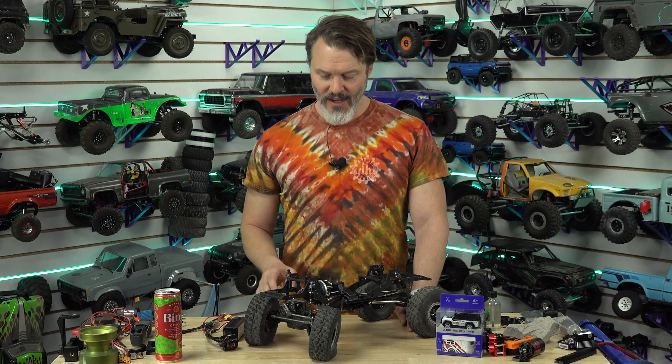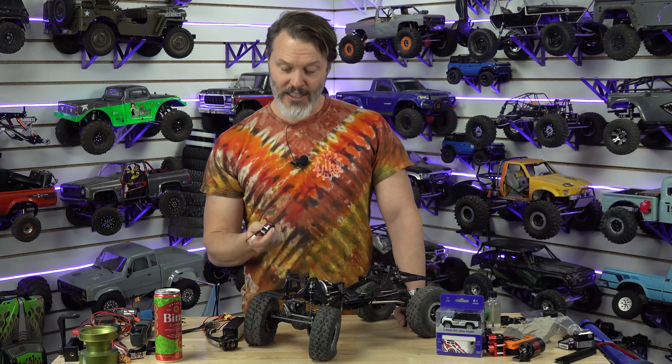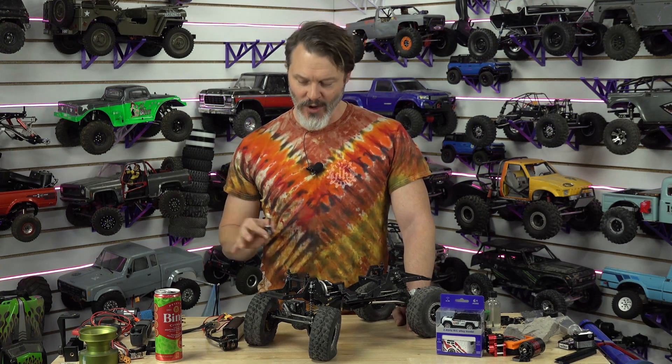I don't want to cast any blame except for on the really tiny batteries. It's obviously related to the really tiny batteries at this point — it's the really high ESR of them. They have a high equivalent series resistance. It's both an inductance issue and a resistance issue, and they can't snub a transient. Now, we've already got the main rail snubbing on here, so maybe you can connect the dots and see where I'm going.